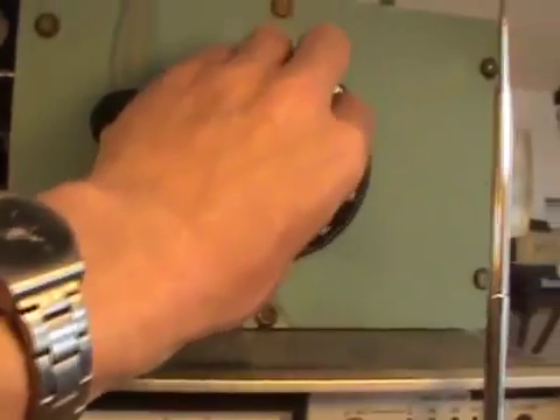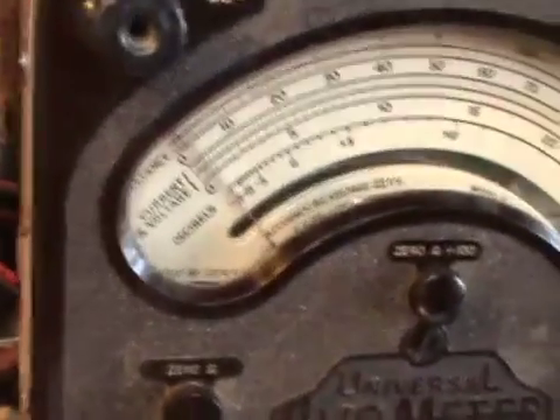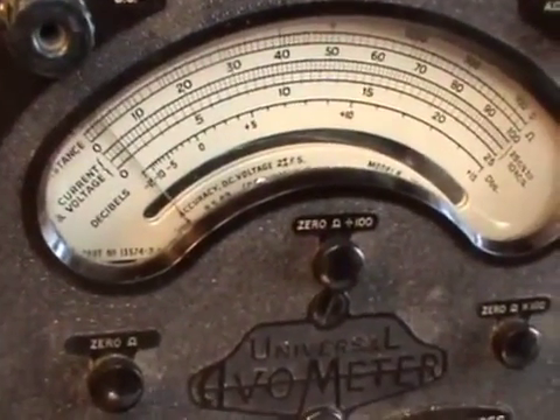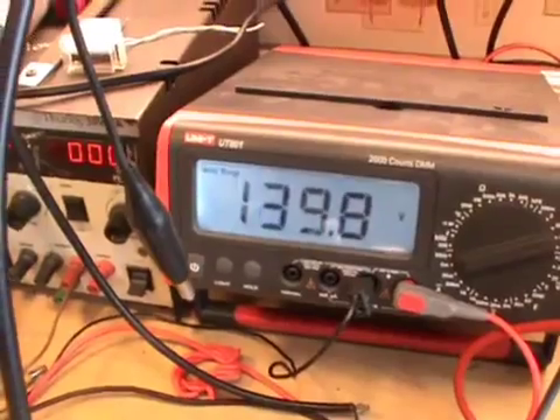To show you that flow, I've come up with a quite unique way. I'll put about 120 volts on the table. I've got audio going into the amplifier and I'm drawing some current. I'm just turning the generator down at the same time. The DC is coming up — that's the anode voltage — and the preamp is starting to come up.